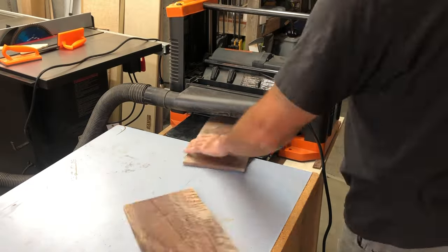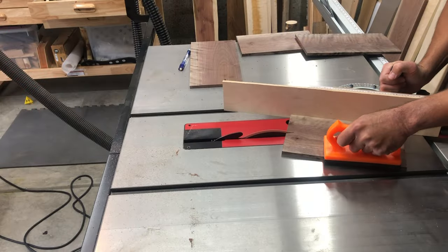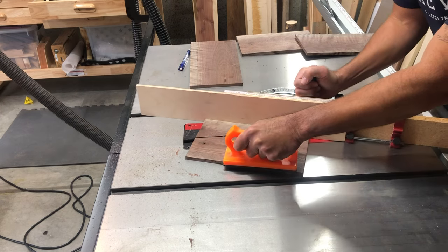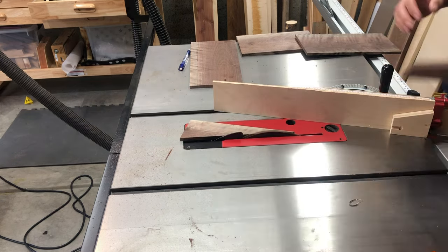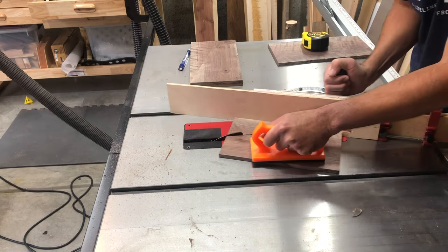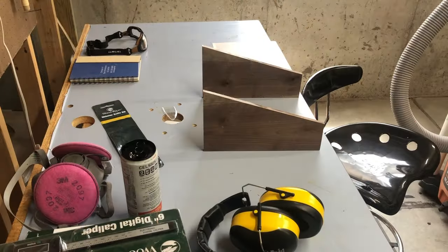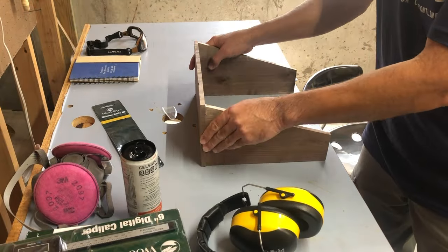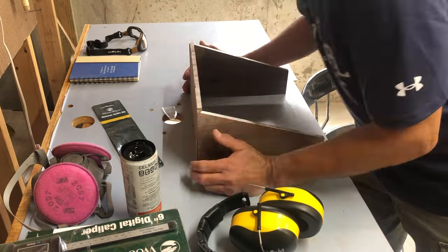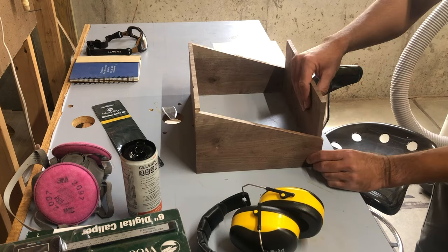You see that I actually did cut these down shorter here. And you see here just the four exterior sides. We did some trigonometry to figure out what angle, and ended up with a 73-degree angle, or 17 degrees depending on which way you're coming from. I just cut those, but I should have done the middle as well at the same time as the two exteriors — you'll see here later I had to kind of adjust for that.